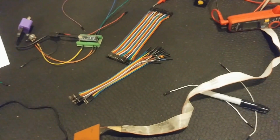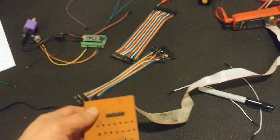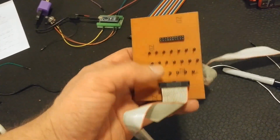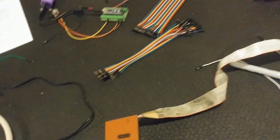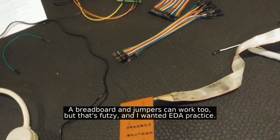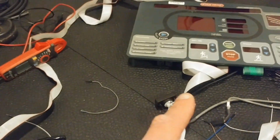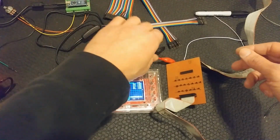But really useful program. I'm still a total novice at it, but learning some things and taking this really tight compacted thing on the ribbon cable and breaking it out to these nice and spacious pins where you can get your meter and get your little DSO138 oscilloscope. And I just looked and I have 2 of these ribbon cables, so I can plug in one cable down to there, breakout board, another cable over to there. The next step is to hook up our probes and go signal hunting.